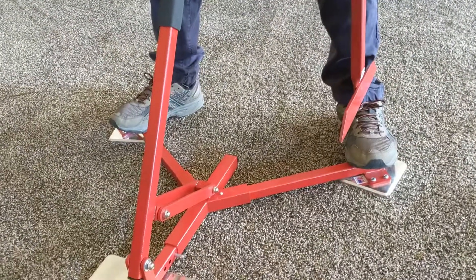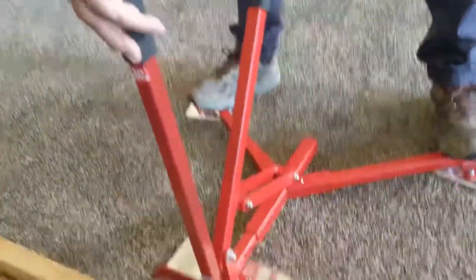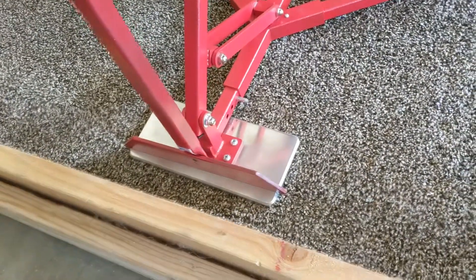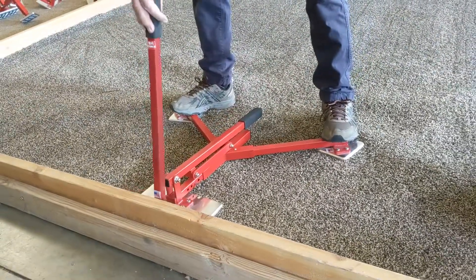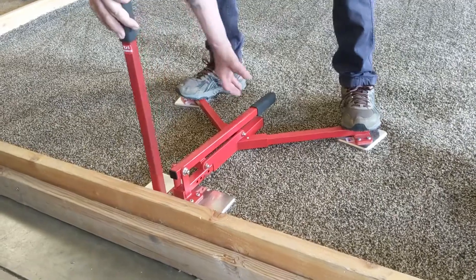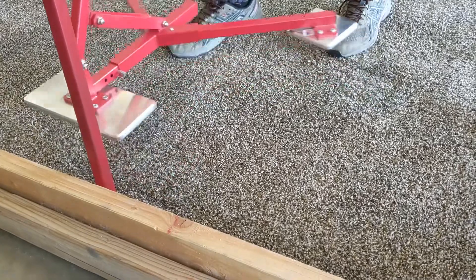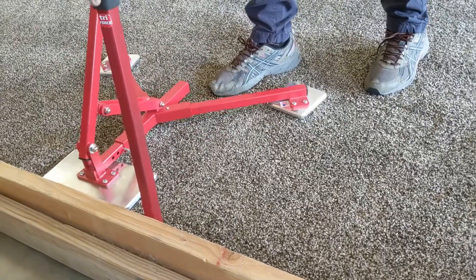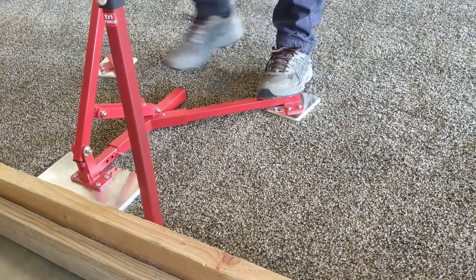Mario, hop at it. Basically, what you do is just place your feet directly on the stretcher, and then you take this pinning device, and then you just apply weight to the frontal part of the tool and press the handle down. The carpet is then pinned. You release the stretcher. You move it where the pinner ends, about the width of the head, and just put it into place right here. You do the same thing.